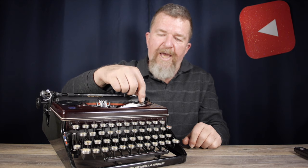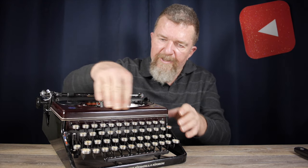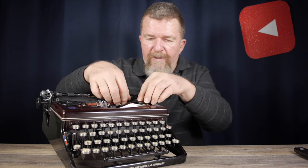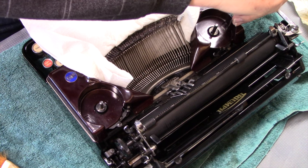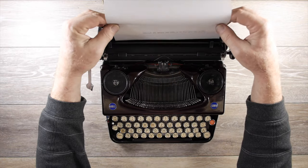I'm using a used nylon ribbon that I had to spool onto the original metal spools. The shafts for the ribbon spools are a little larger in diameter than the universal plastic spool hole we have available, so I just spooled the old ribbon onto the existing metal spools. The whole top is Bakelite plastic and is basically fixed — you pull the ribbon spool off like that to replace it. There's evidence that someone at one time tried to remove this Bakelite cover and snapped two of the corners. When you pull off the ribbon covers there are two screws below, then two more screws, and the whole top comes off — but they didn't see that and pulled it forward, so those two corners are broken. They're sort of behind the back row of keys so you don't really notice it too badly.